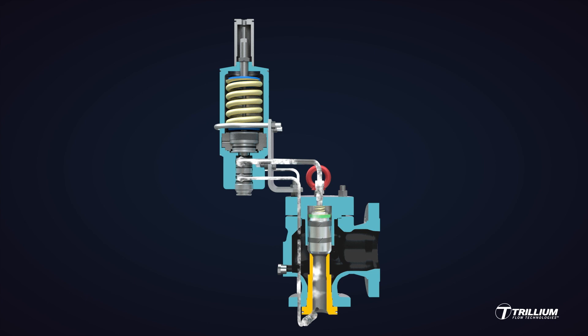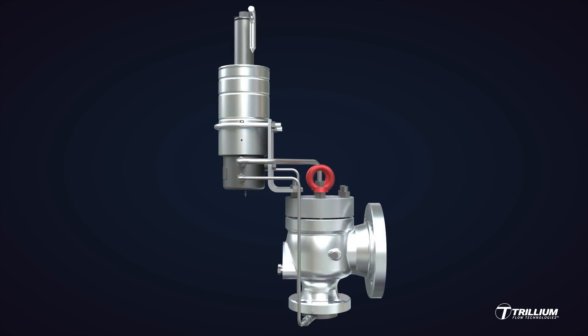It is worth noting that the full nozzle offers the proven benefit of protecting the body against corrosive flowing media. The main valve body, however, is not considered to be a wetted part, as the valve should normally remain in the closed position. This option enhances not only the premium performance and interchangeability of parts, but also reduces the cost of the valve by eliminating the need to use an upgraded body material.